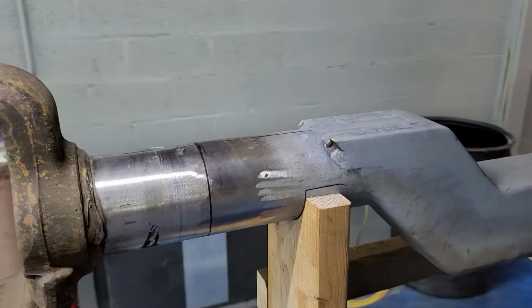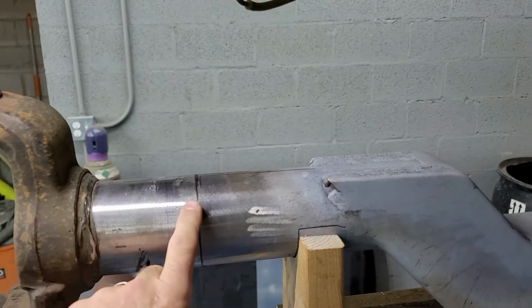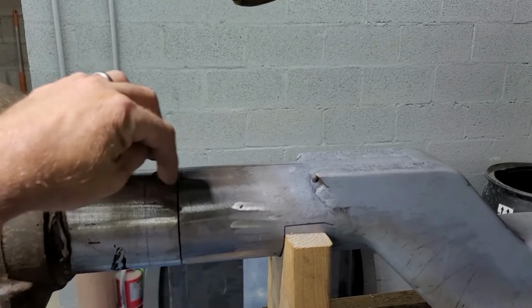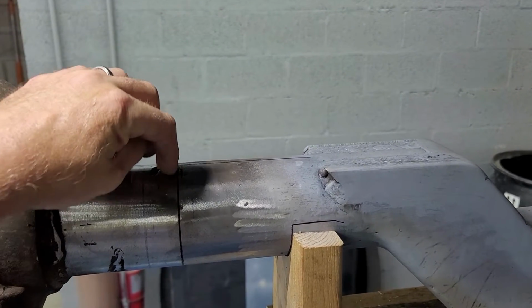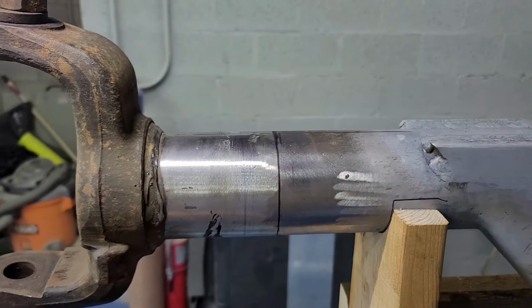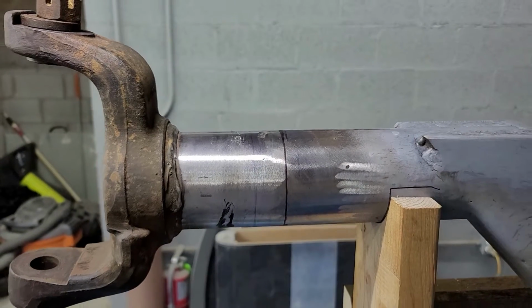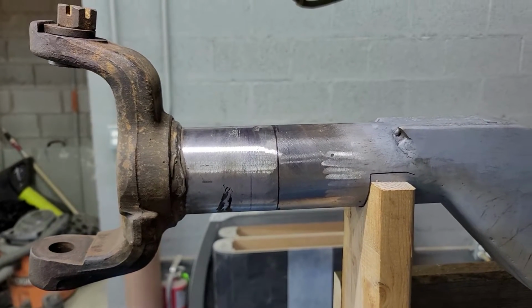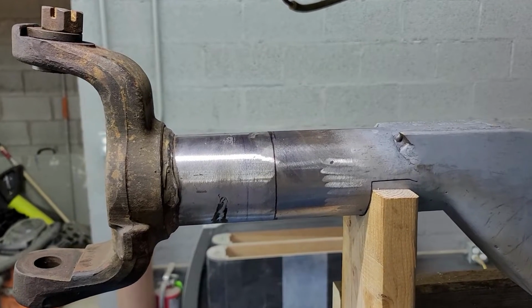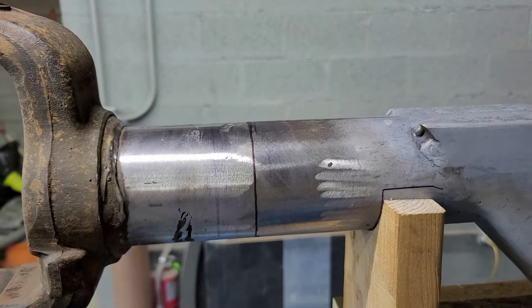Okay, so see where we got our heim joints put together with our piece of wood. Now I've measured out right here 4 3/16 of an inch. This would be the farthest inside point where our bracket will be. So it sits right here. So I'm gonna stick that on here, and then we're gonna let the truck down on top of the axle and make sure everything clears good. I mean, all the math adds up and it should clear, but you know, I ain't no mathematician, so there's a chance I screwed this deal up. But we're gonna stick it on there and let's find out.